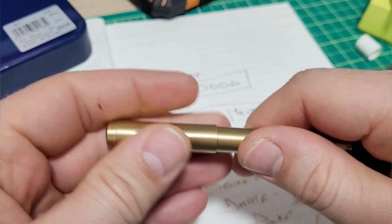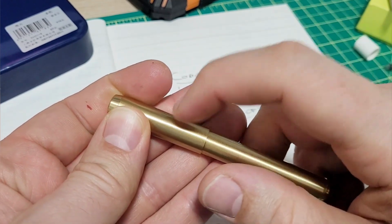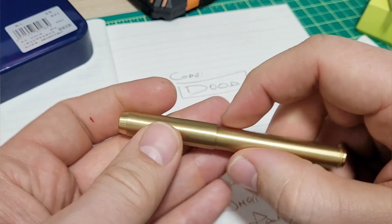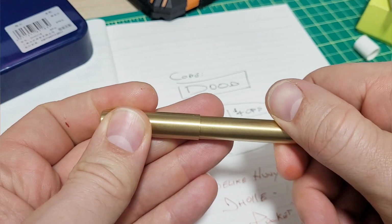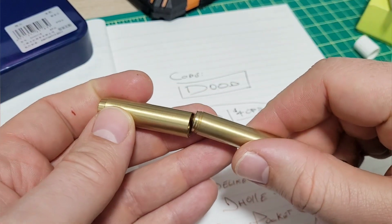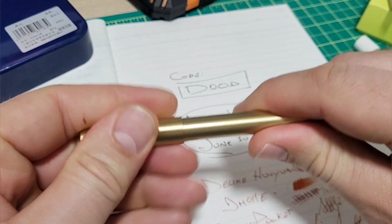If you are a heavy hand person and you want to make sure that's nice and snug, you probably are going to damage those threads over time. Having that piece of metal up there in the cap to help seal, but also as a thread stop, that's how you would do that on a pen like this. Because on other pens, if it's flush, the end of the cap will touch onto the body, and you can't overdo it. In this case, you could if you wanted to. So that'd be one little recommendation I would make in there on the drawing. And then same thing here. It's not as much here. It feels like it's a little more natural stop, but again, don't overdo it.